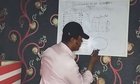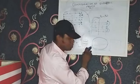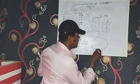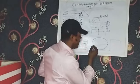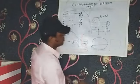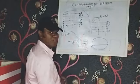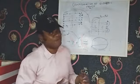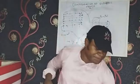If you come here and you open this, by the time the energizer does not get any return signal back, the energizer goes off. But in scenarios where you decide to do it in parallel, you have a parallel connection. If this place is open, this is still giving feedback to this place, like the system is okay. Then your alarm would not go off. Everyone sees it as a fence that is still working. This is just the configuration for a six line connection.